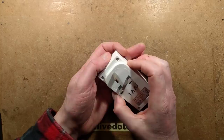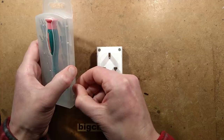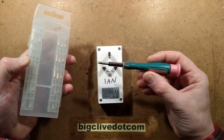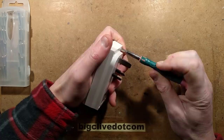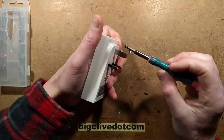The screws in this are the cross split flat blade type, but they're the anti-tamper ones - an extra challenge. I'm going to have to crack out my little anti-tamper screwdriver set. My guess is that this has a capacitive dropper - most of them do - and that the X2 capacitor inside has gone low value. It's basically just degraded over time.